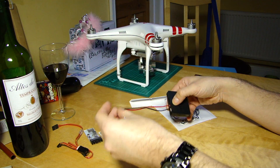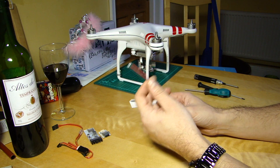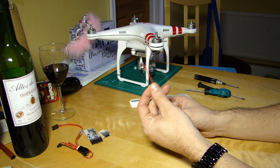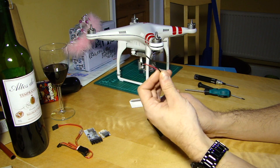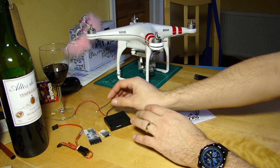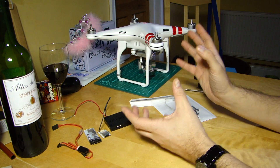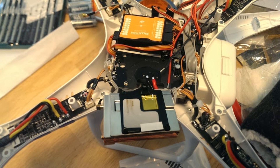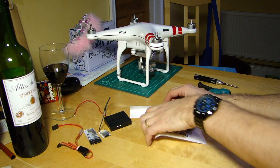There's a 2G version and a new 3G version with improvements — but here's the big downside: the power leads end in tinned connectors because this required soldering. On the Phantom 2 with an open framework like an F450 it's not a major issue, but on the Vision Plus the most sensible place to solder these is underneath the Wi-Fi transceiver unit. There are YouTube videos of people levering the unit up to get to it — and I can see why that would really put people off, and I think Flytrex could as well.